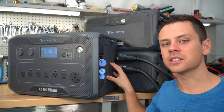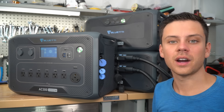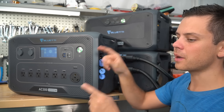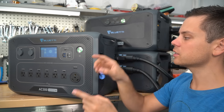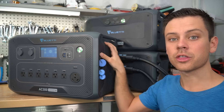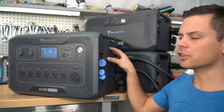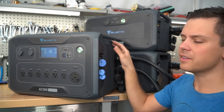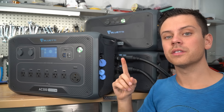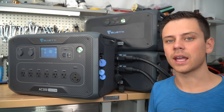Now let's talk about how I tested this model. Instead of doing tests in a single day, which isn't very reliable for finding problems, I stress tested this unit by using it to charge my main solar power system and then using the main solar system to charge this — essentially a loop passing hundreds of kilowatt hours through the inverter circuit. Not a single issue. I also connected a 1,200 watt array to one of the inputs, and every morning it charged up both batteries without any issue.